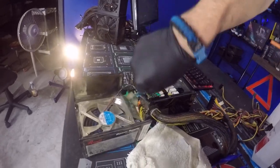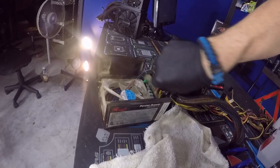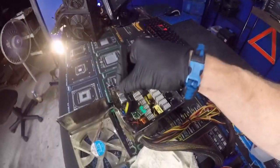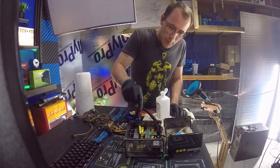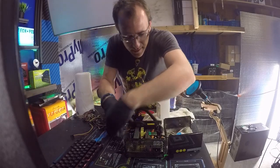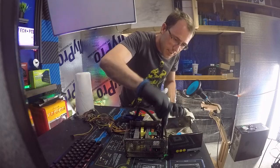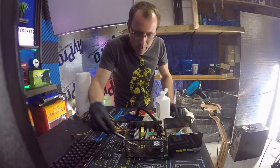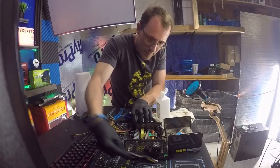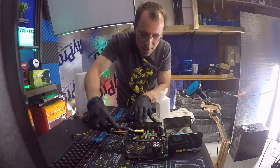Get the circuitry and wires as clean as possible. Get the back of that PCB real good. Then go in with the ESD brush to get even deeper — remember, be gentle. You don't want to short anything out, knock something loose, or cause any dangerous situations. I've been doing this for years, and this is probably my hundredth power supply I've taken apart. Look at all that dust coming out.